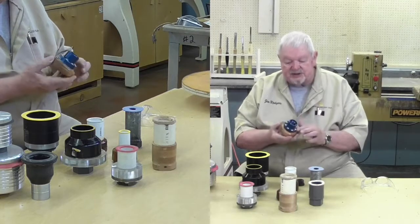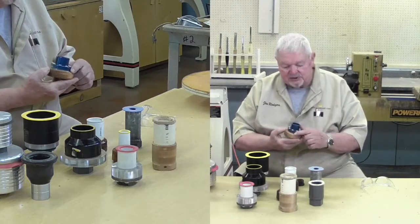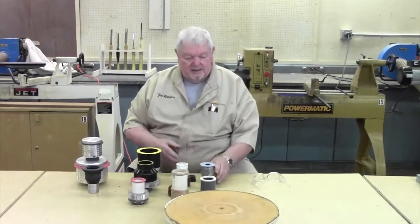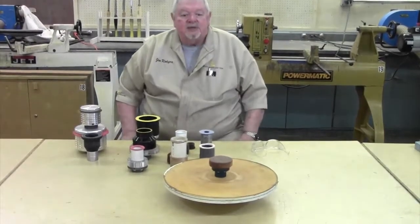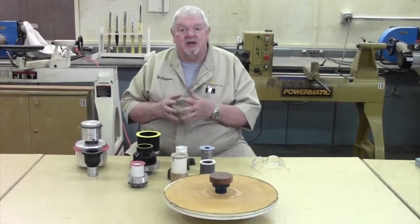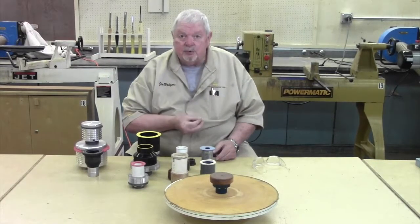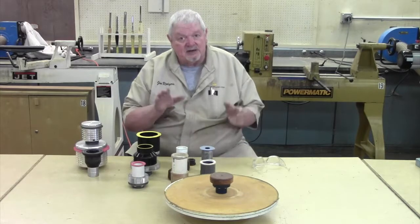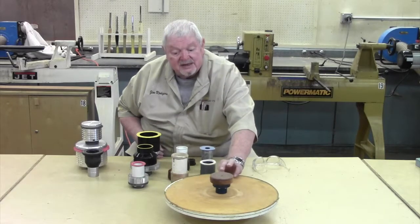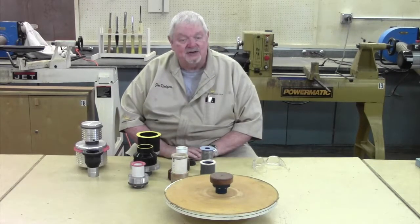This whole surface has been sealed — this is wood, but I had to seal every bit of it to be sure there are absolutely no leaks. Same thing, bigger. Occasionally I have a product that has a flat ring and I need a big flat surface, so I did precisely the same thing: built a tape edge around it, a dam in the center, poured in my mold release material, leveled it off in both planes, and walked away 24 hours later. I have a smooth, flat surface that makes a really great seal. I use that very infrequently, but every now and then it's a nice item.